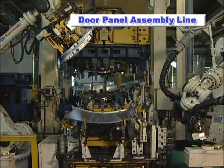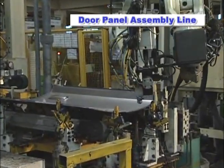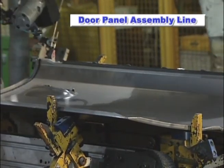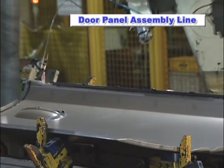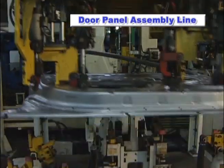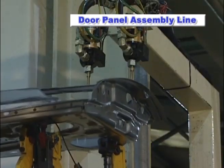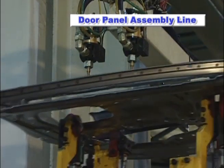As the worker loads the outer panel of the arc-welded workpiece, the DX-165U Robot, equipped with sealing guns, quickly applies sealing agent to the perimeter of the outer panel. The other DX-165U, equipped with a gripper, handles the inner panel and uses stationary sealing guns to apply adhesive to the appropriate locations — point-by-point, quickly and precisely.